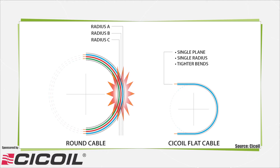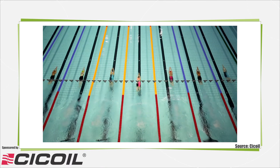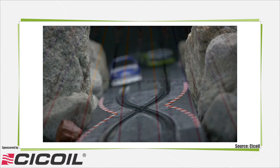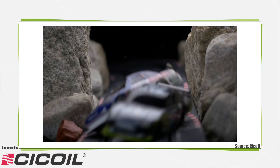Offering small bend radii, flat cables are able to fit into tight and compact spaces and are designed for up to tens of millions of cycles. The conductors in flat cables are equally spaced, with the exact same dimensions to travel. In round cable, however, the wires twist and turn inside the cable, so the spacing and the length of travel varies and it constantly changes.